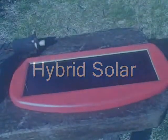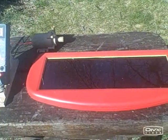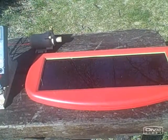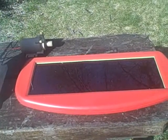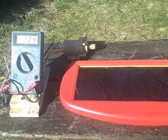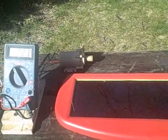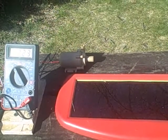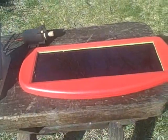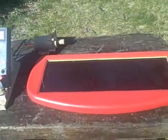A photovoltaic panel may be used in harmony with a solar collector to harvest the heat energy from the sun. If there's enough power supplied by the photovoltaic panel to power the pump, there's not a problem. Now, what you're looking at in the back there, that's a little 6-watt pump. It's a tough little pump, but you need 6 watts of power. Do you think this panel will supply us with enough power to power this pump?